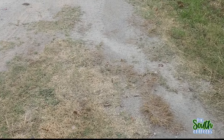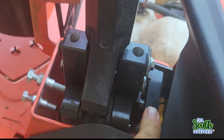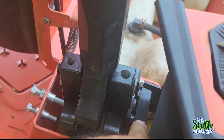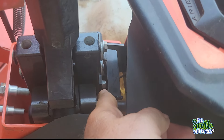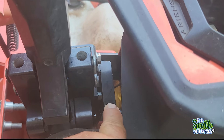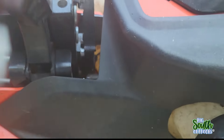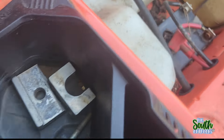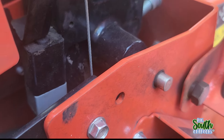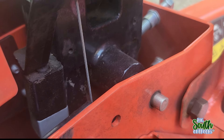I talked about in the 'I'm in Hell' video about these things right here — you see how loose that is? With 191 hours on it, that should not be like that. This metal right here is so flimsy, especially in the summertime. It's like a 32nd of an inch thick, and over time, going back and forth, this metal will bend upward and actually prevent you from engaging that safety switch right there.